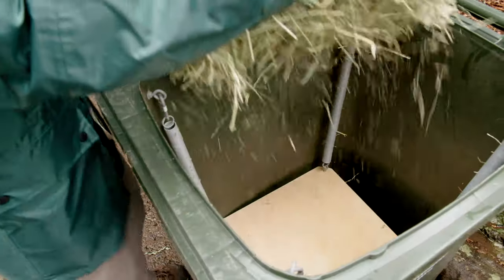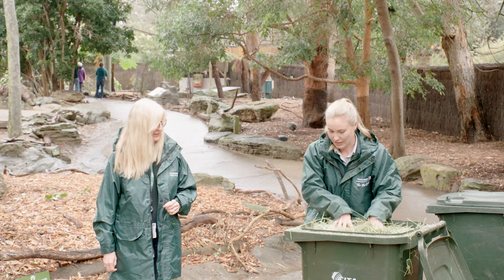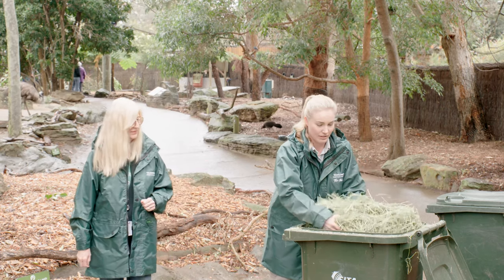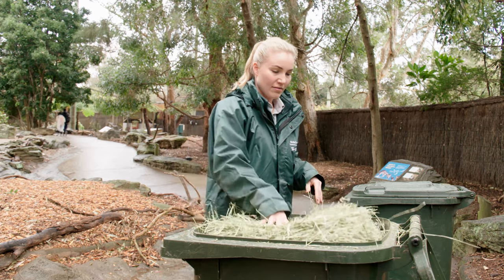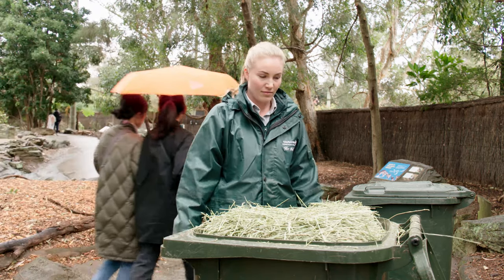it's more difficult for them to actually reach the bottom of the bins. So the spring-loaded lifter has four springs on each corner of the bin on the inside, so once you put a bale of hay in, the springs will release and allow the weight of the hay to go all the way to the bottom of the bin, and then as you remove the biscuits the springs will lift because the weight is lighter.